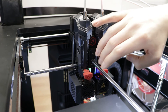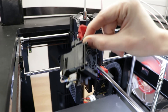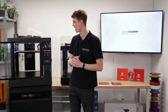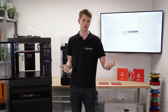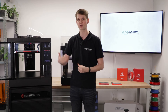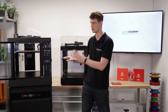They also came up with a cartridge system for the print head. By just lifting up a little red tab, you can remove the entire hotend assembly and swap it out for a new or different one. You could keep multiple ones at hand — for example, one with a brass nozzle and one with a steel nozzle. As soon as one gets worn out or clogged, you just swap it out, recalibrate, and keep printing, then take your time cleaning or replacing the old one. Nozzle swapping was always a lot of work on the Pro2 — no such thing anymore on the Pro3.